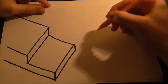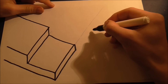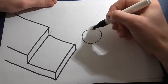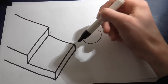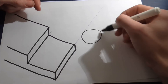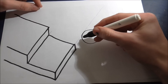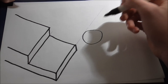I wanted to pick up on this point because it's a fairly fundamental CNC concept. Imagine at the moment we have our tool here and the edge of it is right in line to cut the piece to this length. If the length is incorrect — say it's too long — there's an easy fix rather than going back into the program and changing the length or the distance. What I can do is change what I'm going to call my tool diameter offset. At the start I set up the diameter for the tool; what I can do is measure it and go back into the offsets page and change the diameter of this tool to account for the discrepancy.